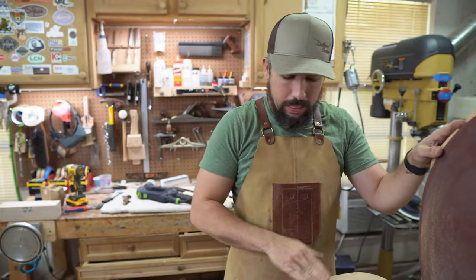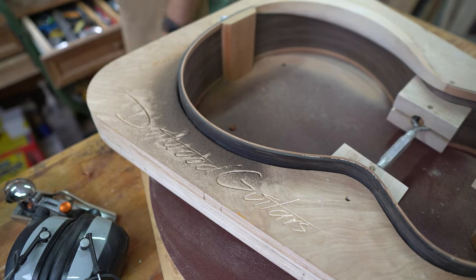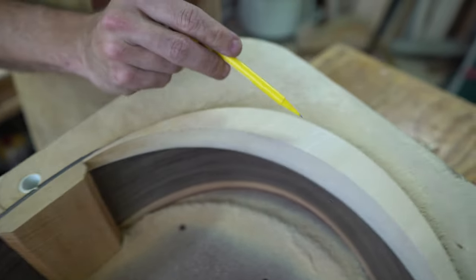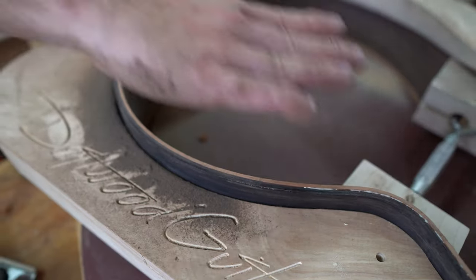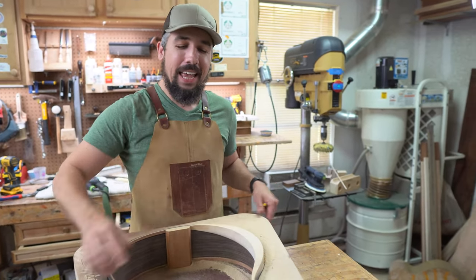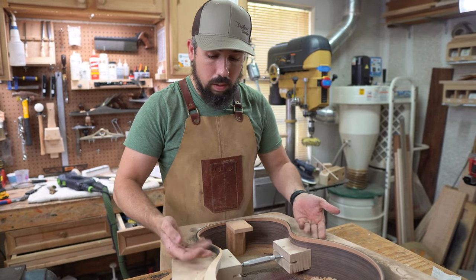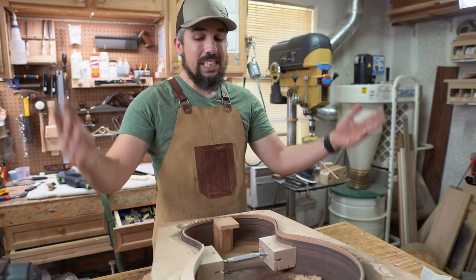What we have — starting right here — is basically where the sanding started. You can see the kerfing, the laminate piece, and the outer piece, going all the way around. Our radius is from here all the way down, so the whole thing should fall away very gradually. The next thing we're going to do is get this upper section nice and flat — we want to sand it so it meets that point where we drew the pencil lines, so it's flat and then radius. This is what's worked best for me. I know there are people who say that's not how it's done, but remember — there's no one way how it's done. This is how I do it, and it works well for me.